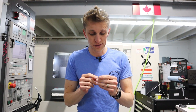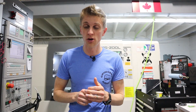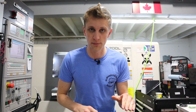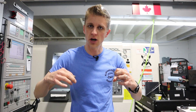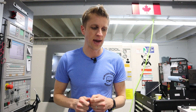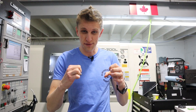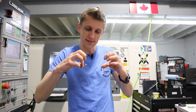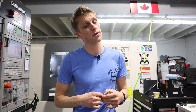Things are going really well. We're making number 47 right now. I just made three in a row and they're going great — zero problems whatsoever. I also want to add a couple more safety checks: pull sensing, called cutoff detection on the lathe. That way it knows if the part has actually been pulled off. It measures all the load and everything, and that is working super well.